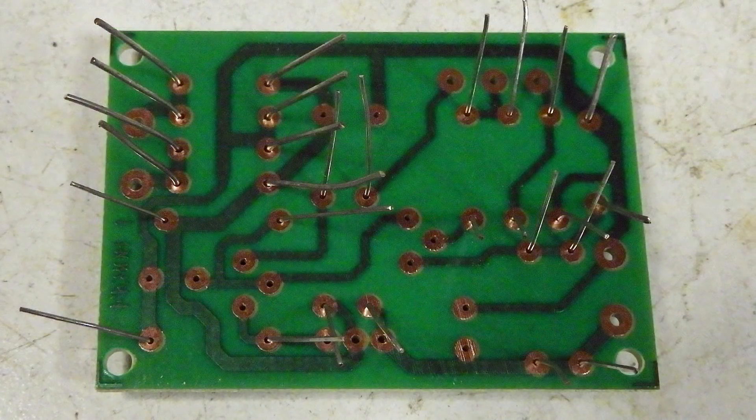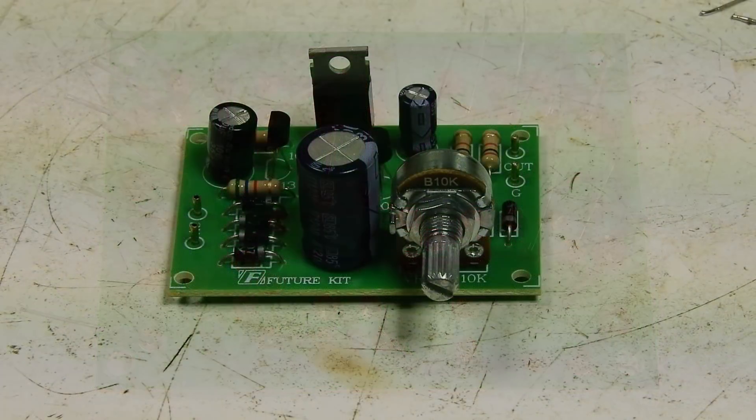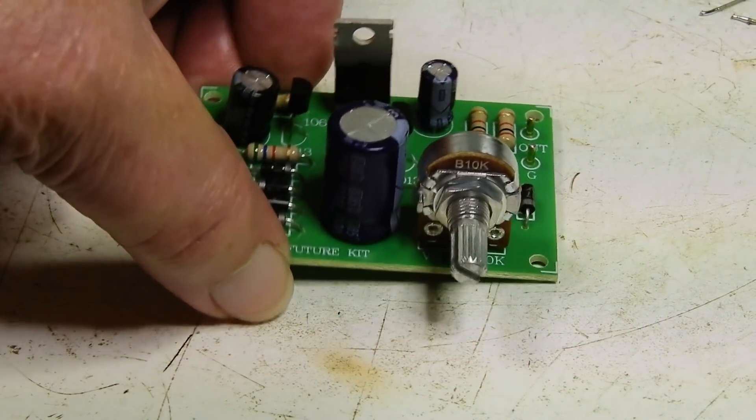Here's the underside of the board — I haven't soldered it yet. When I start soldering I'm going to start on the right-hand side, the farthest resistor, and solder that one first. Then when it's soldered in I'll cut the leads off so they're no longer in the way, and I'll just work my way into the board. This works quite well. Here's the completed board.